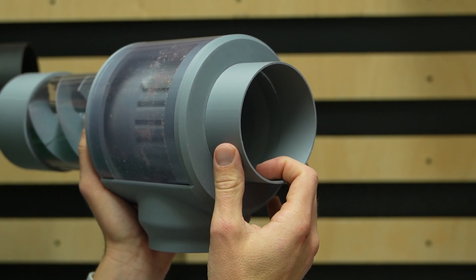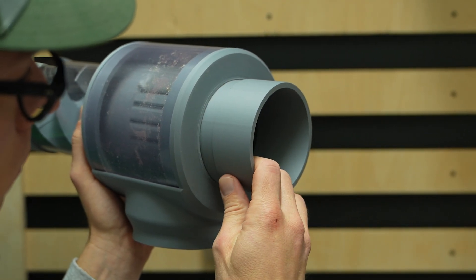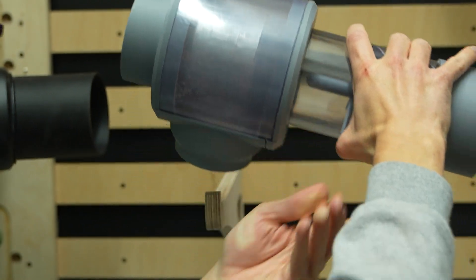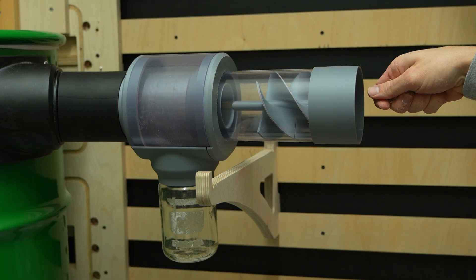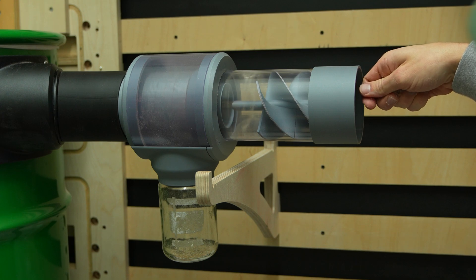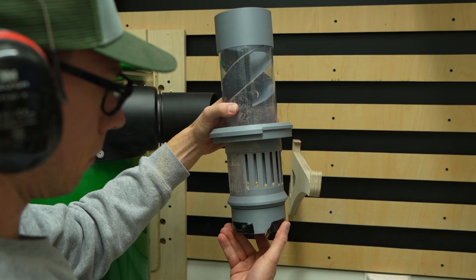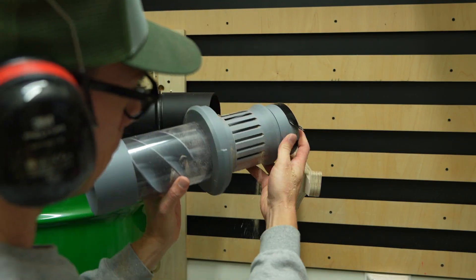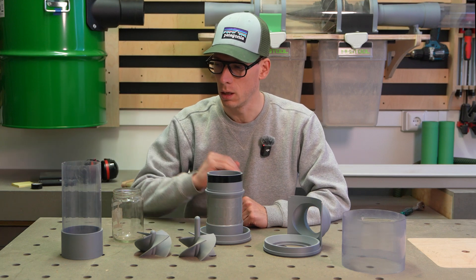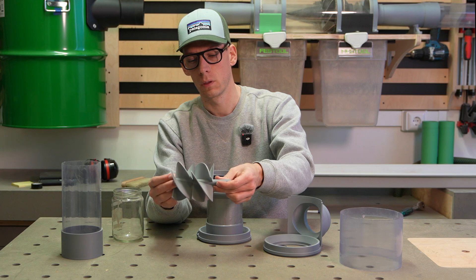The next morning I assembled the remaining impellers and discovered that 2mm PLA wasn't strong enough for the final section of the core. To avoid waiting 8 hours for a reprint of the core I quickly printed an adapter instead. For the test I partially covered the dust outlet ports with tape to channel the dust more directly into the jar, and did a quick test with small dust sizes and some larger wood shavings. The larger particles got trapped at the end of the dust ports, which is something we need to fix. The main components are the 100mm tube, the 6-inch tube for the outer collection chamber, and the impellers printed back to back.